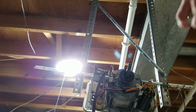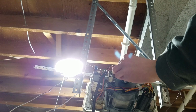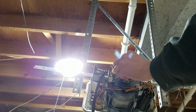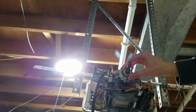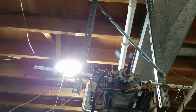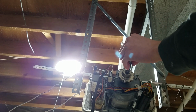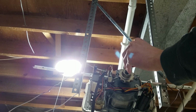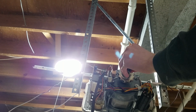Then next is your reluctor hub. Remember, there's a keyway here, so you're going to have to turn it some. And that's what's going to go on next. You have the tiny little ring keeper, which goes on next. Again, this one will take a little bit of patience.